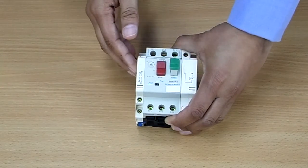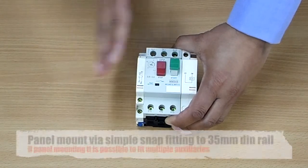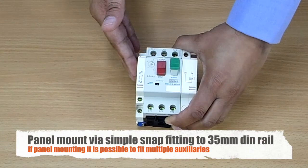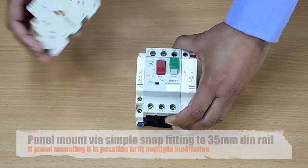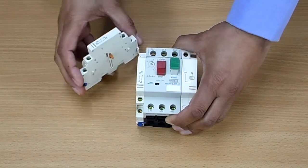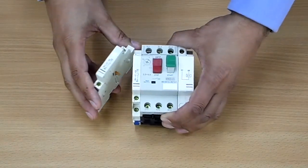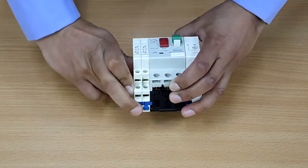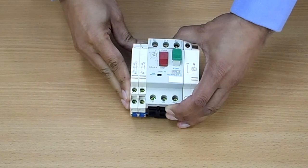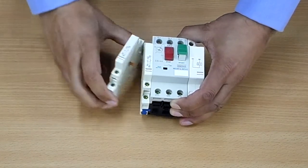In this state, this can fit in one of our IP55 enclosures. However, if you are panel mounting this unit you can actually add extra auxiliaries onto the same side. Again, with the hook put in place, make sure it's attached up and push in place, press the blue tab. And there we are — we have an extra auxiliary, and it's very easy to remove as well.